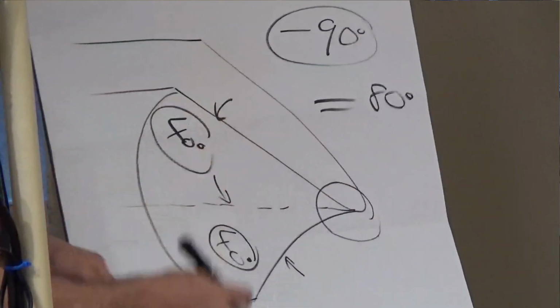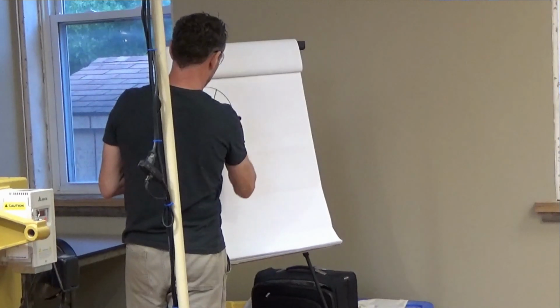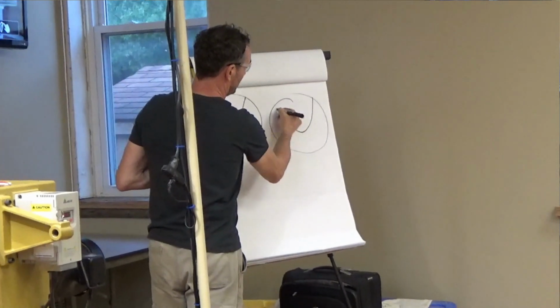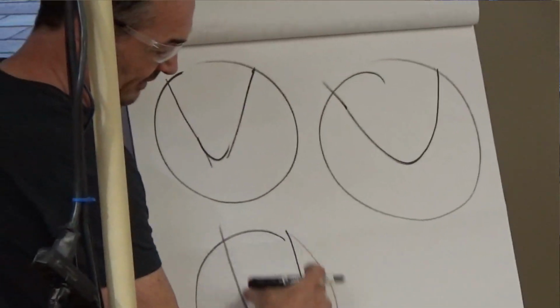And all the gouges that we're using, we want to be using a gouge either with a V or an elliptical flute. It cannot be a U flute. So it must either be V, like a Thompson, that's a V gouge, or a European gouge, which is elliptical, very similar, elliptical. But they must be some form of V.